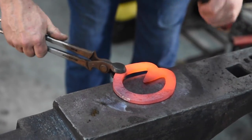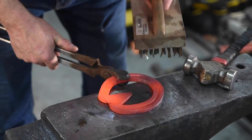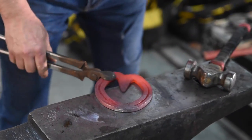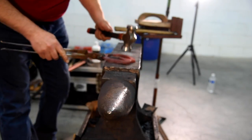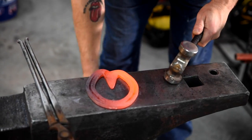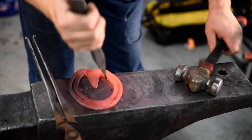And there's not a lot of stretch on the frog bar itself, on the heart, towards the toe, because you've set it up. You should get about maybe half an inch from it, if that. But the strength of the heart bar, depending on what you're using it for, the type of foot, whether it's surgical or it's, you know, usual support for a heart bar, the uses are endless. So, but you can make the heart bars very light in their body. They don't have to be thick all the way through. Sometimes I like them to be sort of angled down from the ground surface down to the tip, just so that it keeps a light bar to them.